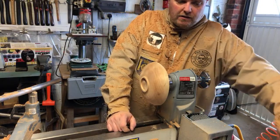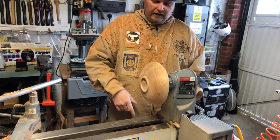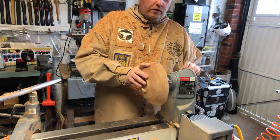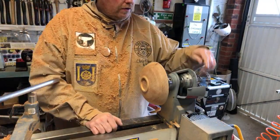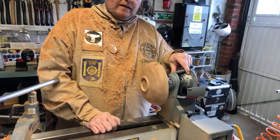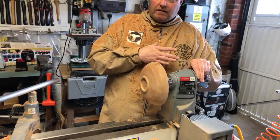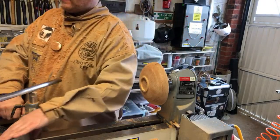What I'm going to do is disconnect the lathe, because if I'm carving and the spindle locks on, and I inadvertently hit a button, you don't want the motor trying to spin with the spindle locked, and an accident. So I always disconnect it. I'm also going to lock the spindle. You guys would be able to open your doorway and get the right spindle position, the indexing numbers all correlated and everything like that, whereas I'm just going to do it as good as I can, trying to remain organic and random, but with a purpose. I'm going to use the points of the compass. So that's how I do it in my head.